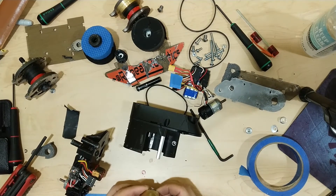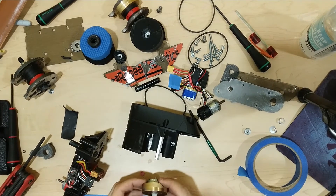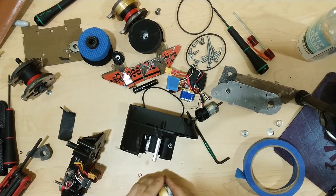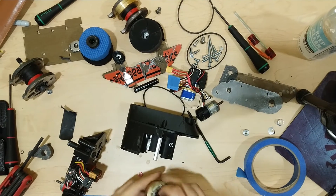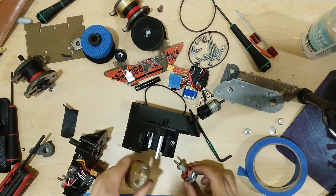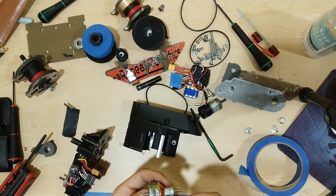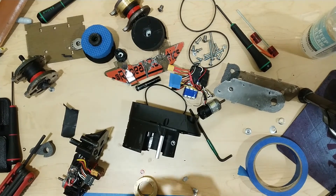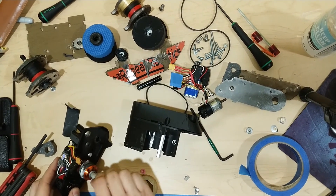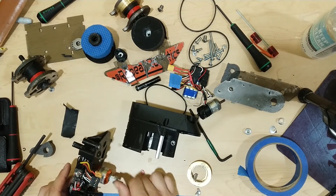It's loose — let me see if I can pull it off. It's still glued on one side and the glue on the other side is acting like a spacer. This counterweight is beat up and all the stickers from my motor are coming off. That damage got that deep — I'm surprised. But the shaft's still straight, so the counterweight just got shifted. I'm surprised it didn't bend this eighth-inch shaft.